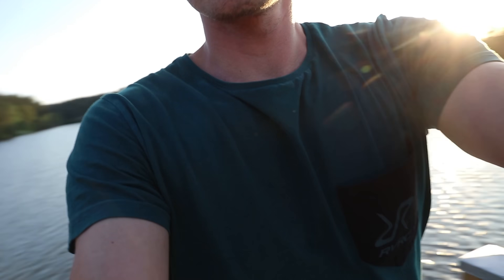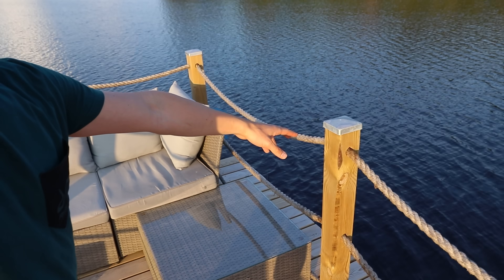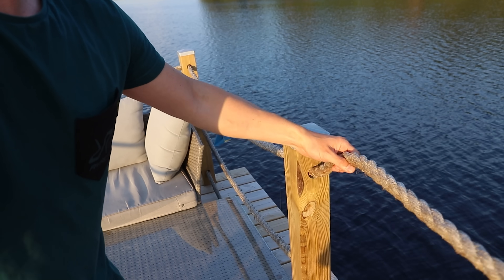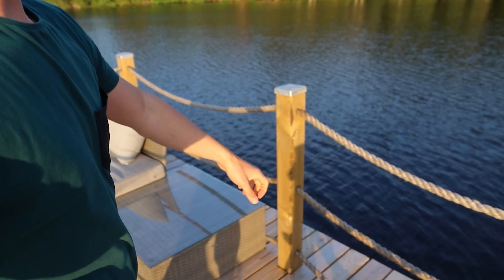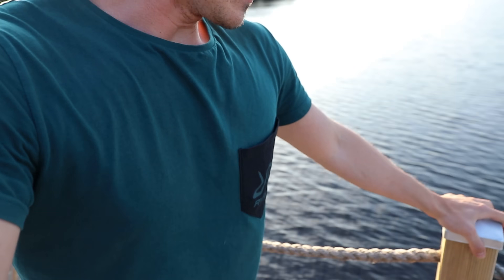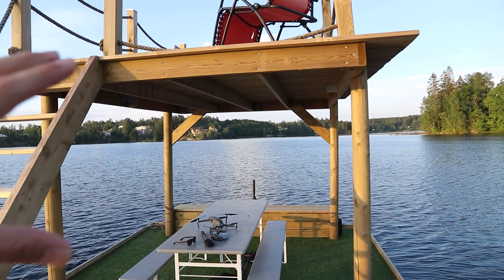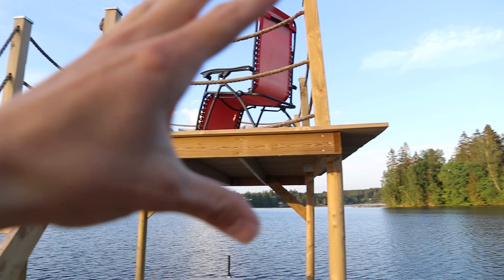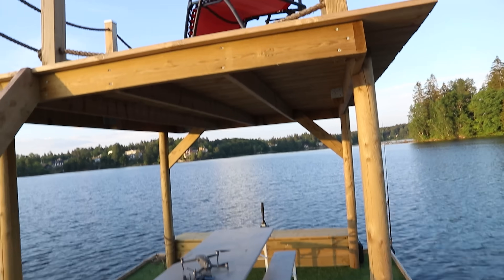I just want to show you the posts — we made holes in them so that rope could go between all the posts as railing. That wasn't such a good idea because when the rope gets wet it gets really tensioned, and when dry it goes all slack. Once it's wet and in tension it makes all the posts really loose because it's dragging them. The question is really how reinforced you want the top floor to be — you could have diagonal pieces on all four corners of the posts for a super sturdy top floor.